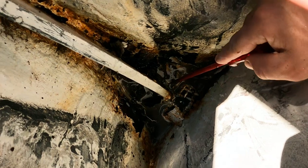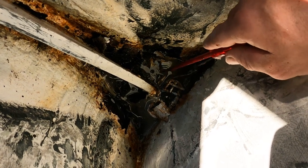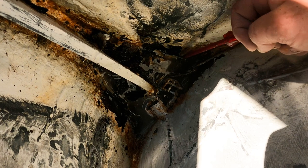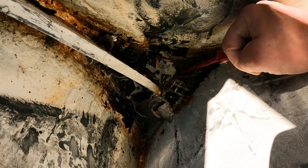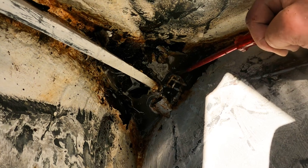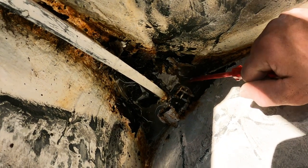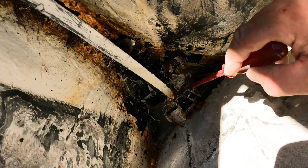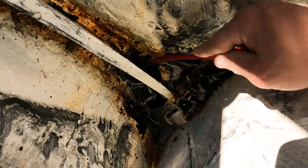This is probably another reason why they should have made these drains a lot better. Even though they tried to fill with resin, if the steel swells at a different rate than the resin it's going to create a little gap and water gets in. They should have made these drains flush with the bottom of the hull so the water goes straight out. I'm assuming they thought this was going to be a chain locker and didn't want a wedge for the chain to get stuck in, so they put a flat bottom in — but it's not better for the boat.